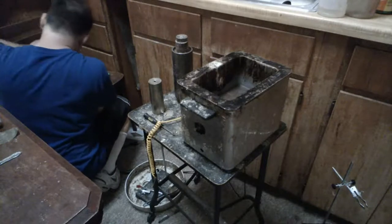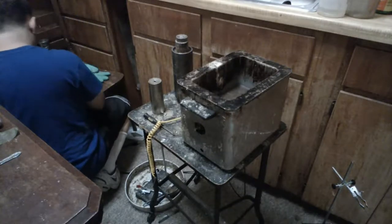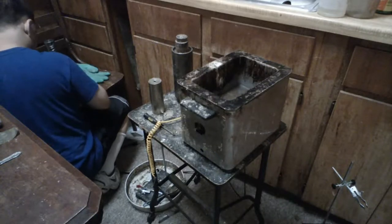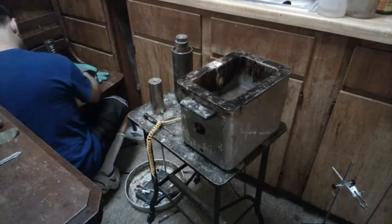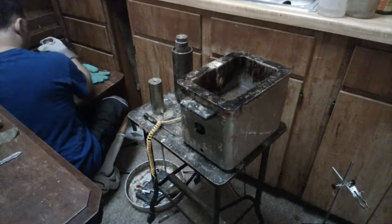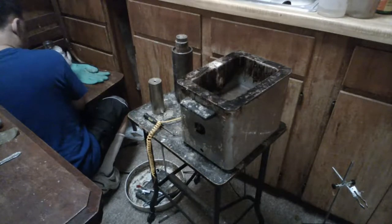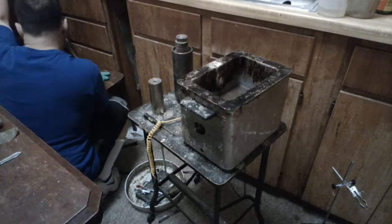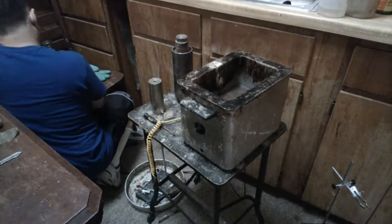One day I tried not preheating the blank mold, just to see what it would do. The first time I was kind of in a hurry, so I tried to mold a cylinder without heating the mold up, which is kind of a silly idea, but it actually was helpful. When that cylinder was done, it bound on the core, and it was a good learning experience.